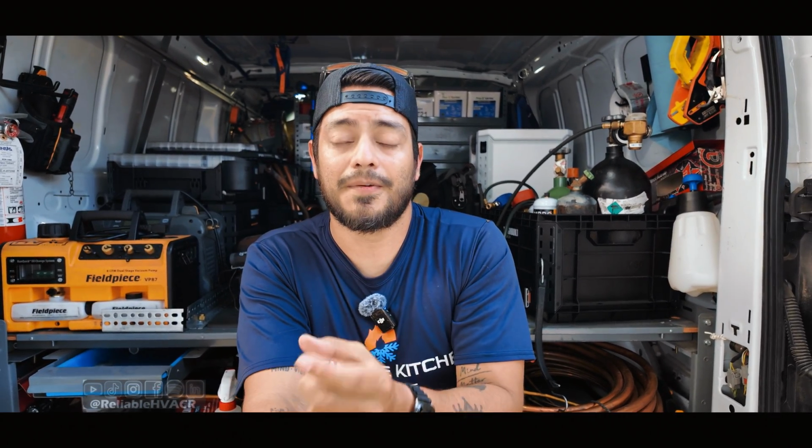All right, guys, so hopefully that was helpful. That's just how I can kind of simulate real world use. You're going to see these in my videos. I've been using the Appion ones, but I kind of got tired of guessing if I got the Schrader out. So AccuTools, JB, and now Fieldpiece have a pretty good, reliable way to lock onto the stem and get it out. So those are going to be my preferences when I'm replacing leaky Schraders.